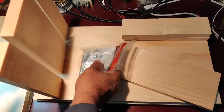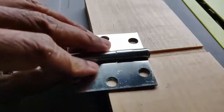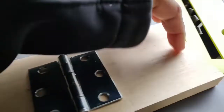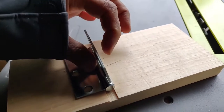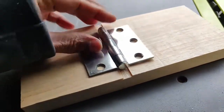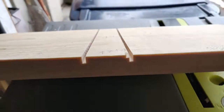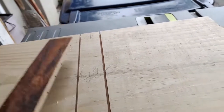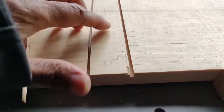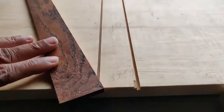Using the table saw, I made a groove for this hinge, because this needs to sit flat. This is the top, this is the bottom, and this is the bottom of the bellows — so this can move this way and will be screwed here. Now this will be the top of the tuning table, and this is the slot I am making using the table saw. This piece should slide into this one — I have started the edges and now need to clear off the middle so it can slide freely. The slot is done.